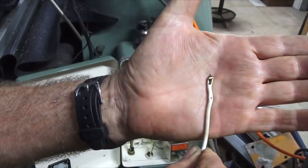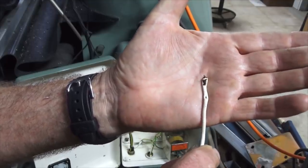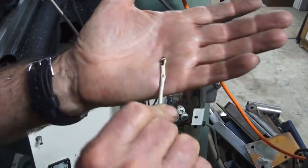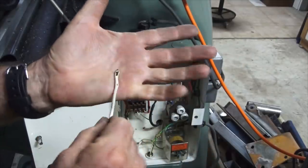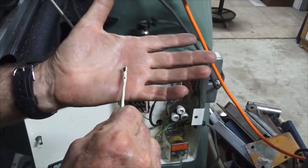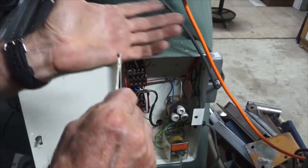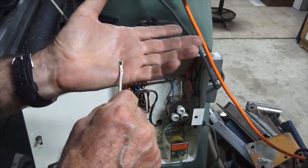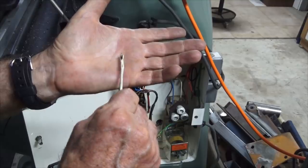So I think what was happening was that those wires were making contact originally, but as I was starting and stopping the mill to do this test on the DRO, the heavy current draw heated that junction up until it just simply failed. Now, when I got in touch with Yuri, I said, I think I found the problem, and he agreed. He said that when you have a contact like that arcing or sparking, it will act like a radio transmitter, and that can upset either the scales or the Bluetooth adapter. And I think this was an accident waiting to happen. It could have failed a lot sooner and probably in more dramatic ways than what it did.